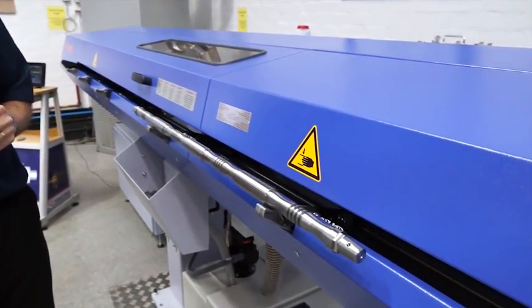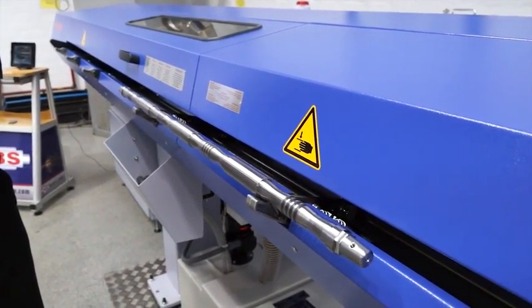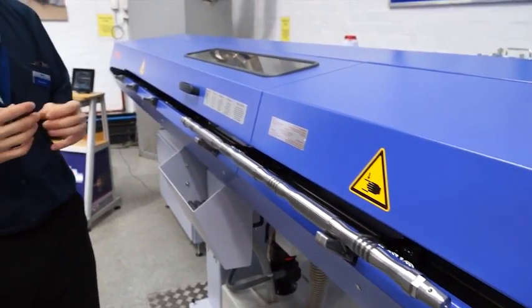Alec, we've got here a shaft. You're machining this on this machine? Absolutely. This has been done on an SR32J. We're doing this and supporting it in the sub-spindle at the same time. So it's very much a staged process, machining the shaft all the way down.